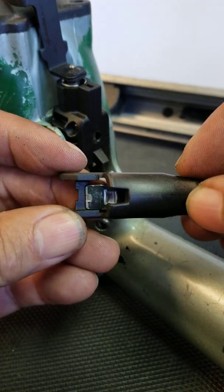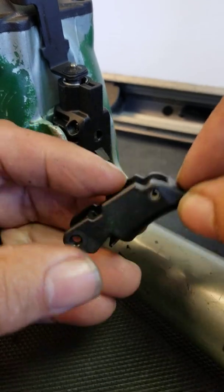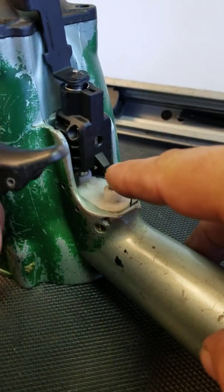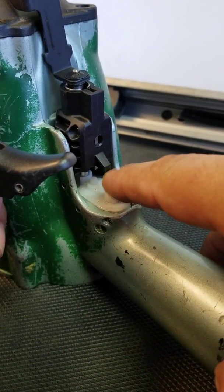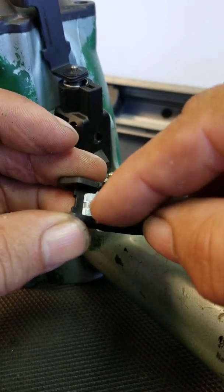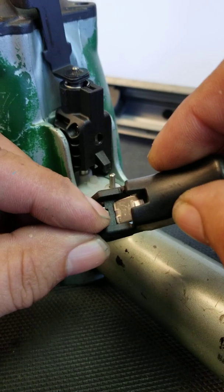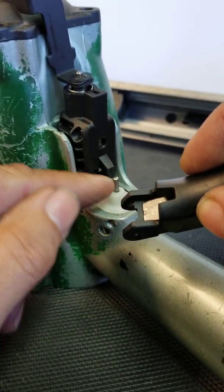So if that plate is kind of worn and you've got the tool and you're trying to troubleshoot it — it will not engage just by pulling the trigger — go ahead and in your test area actuate just the plunger itself. If the tool cycles, check that plate. See this one here has a real hard wear spot on the end that might make it to where the plate won't engage the tool.